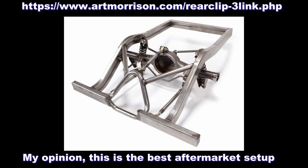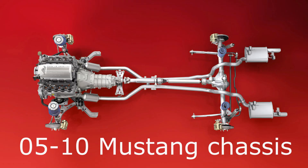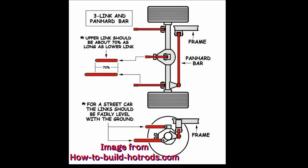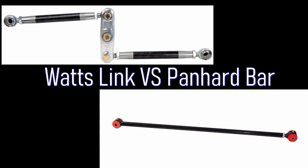Doing the research to build this, I knew I was starting with a blank slate. I decided on a three-link suspension for a few reasons: first, it gave me more packaging room for the shocks and airbags I wanted to run. I had very limited spacing to run the upper links due to the short distance from the cross member I built to the centerline of the differential. I used the 2005–2010 Mustang as a foundation for learning how to build the three-link, as well as some aftermarket systems. I created cardstock templates for all my link arms — the top link went from the top of the diff to the cross member, while the lower arms went to the bottom, and were thirty percent longer than the top link.